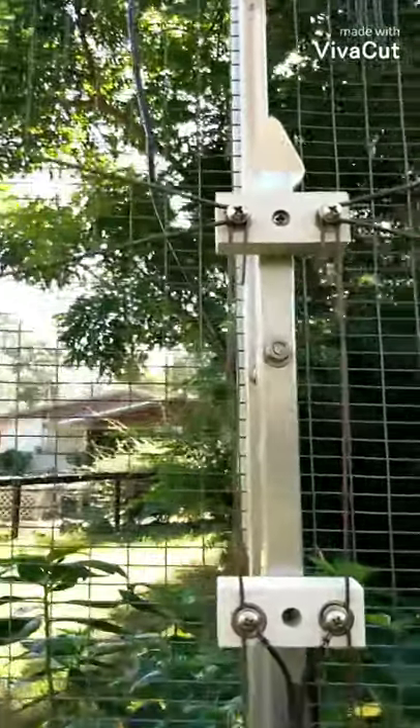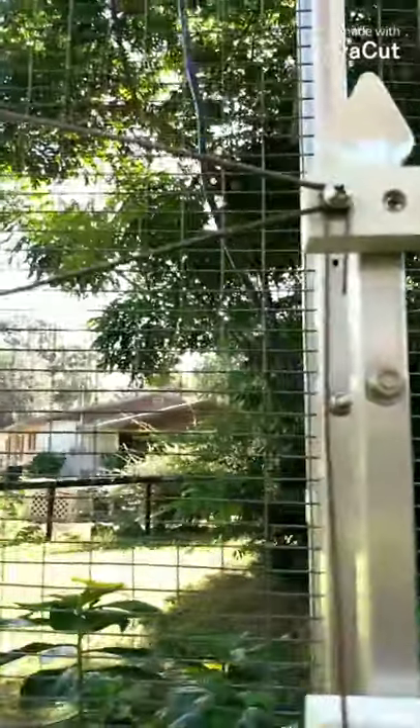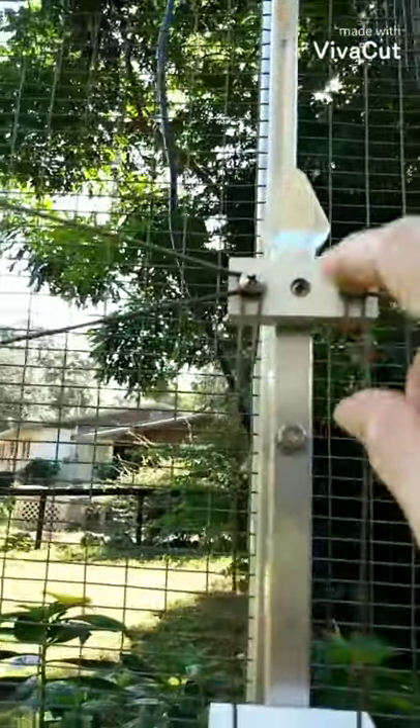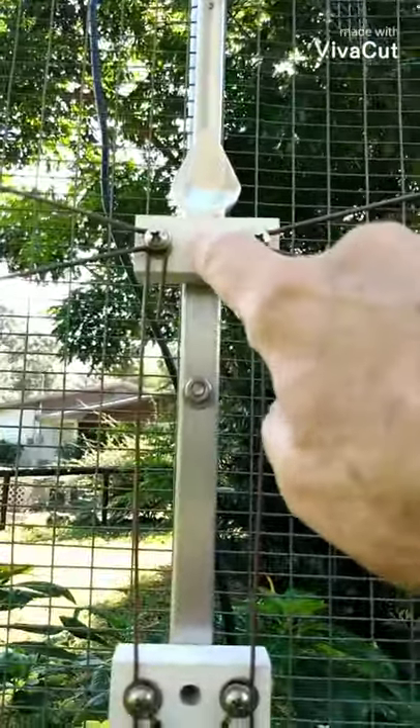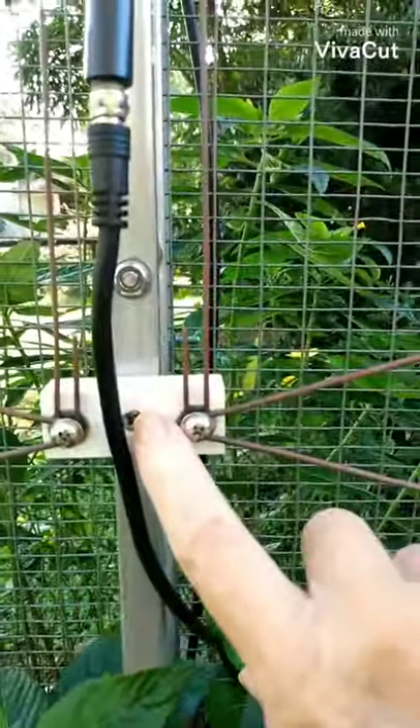I've been impressed with this antenna. It's a 12 because these bow elements are 12 inches long, and it's by 15 because the space between here and the bottom is 15 inches, and this is dead center — seven and a half.